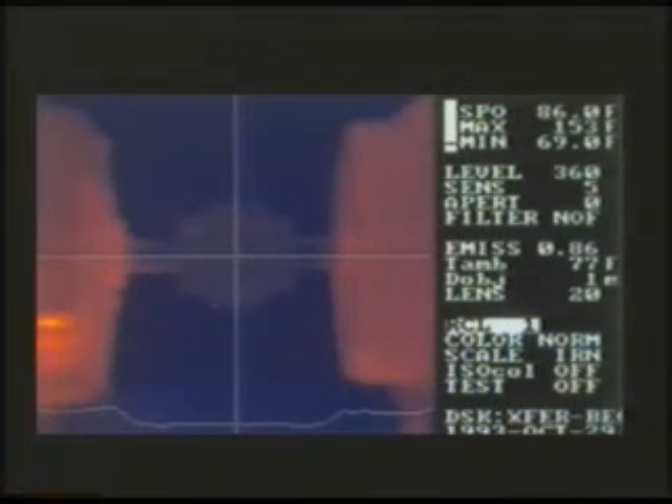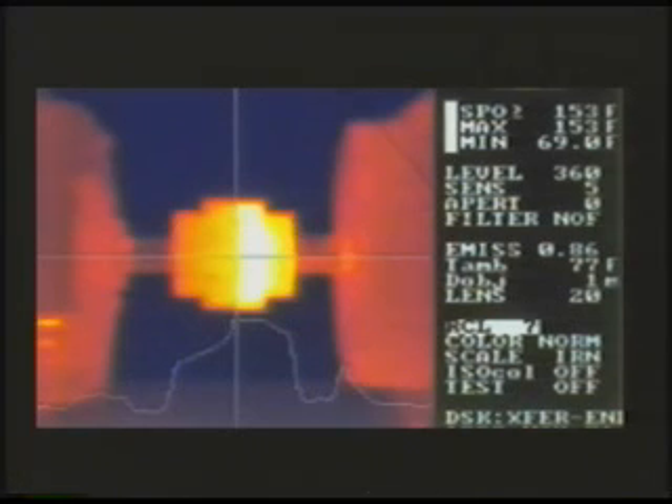So given the case that maybe the vibration problem has been solved, is it still just as necessary to go ahead and maintain regular precision alignment? Yes, it is. One of the reasons is energy loss. If we look at a thermogram, we can see a coupling here, and when it's properly aligned, the coupling is dark — and for a thermogram, a dark area means you're not generating any heat. But in the second picture, where the machine is misaligned, the coupling and surrounding machines have turned red, indicating we're generating heat. Heat is, by its nature, an unnecessary loss of energy. Some people say, well, I have flexible couplings, I don't need to do precision alignment. But as we can see from this thermogram, that's not true. We're still dissipating energy in the flexure of these flexible elements.